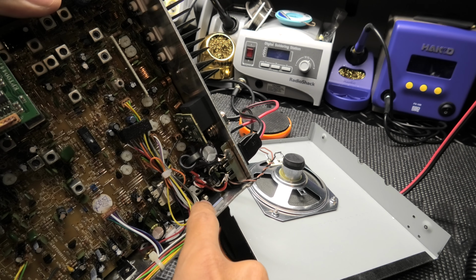So all the way down, keys 1 watt. Maybe a hair under 1 watt. Yeah, right about 1 watt. All the way up, 6 watts. Okay. Now put the mic gain all the way up, and we'll check out average power. So once again, we'll go all the way down, 1 watt, about 15 average, all the way up, about 20 average, maybe 21. Very nice. So we'll go into peak.